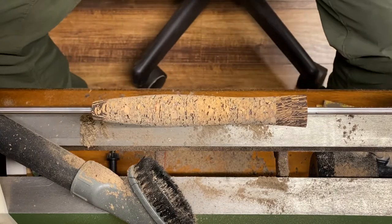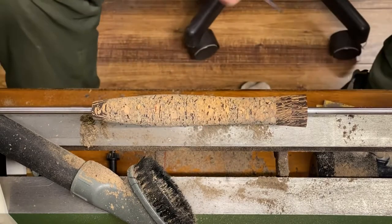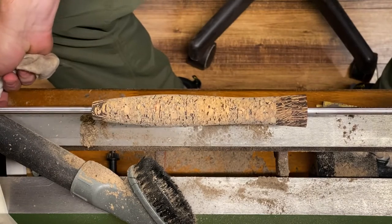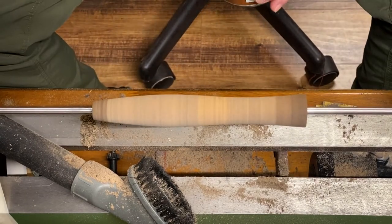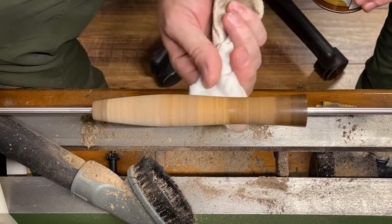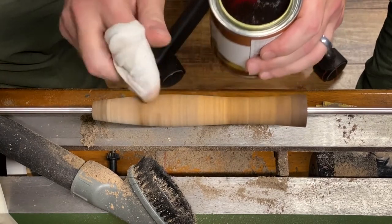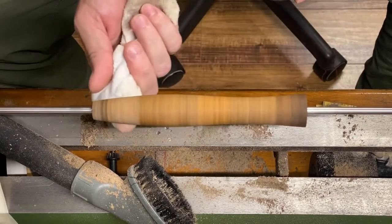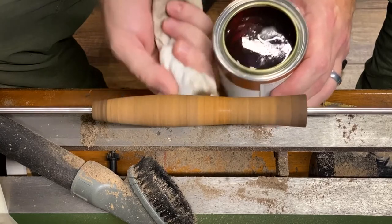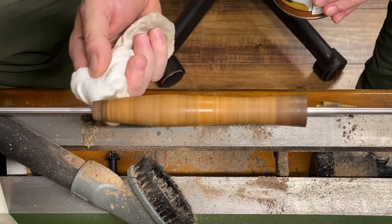It's finish time. This is what I use — good old Watco butcher block oil. We've got it all shaken up, we're going to turn the lathe back on and dab a little bit of finish on. Look at that — it's going to be a pretty grip. This cork soaks up finish like crazy so don't be afraid to use it because I'll end up putting several coats on. You can see it darkens it up a little bit — it does dry and lighten up, especially after we buff it in. It'll be beautiful.